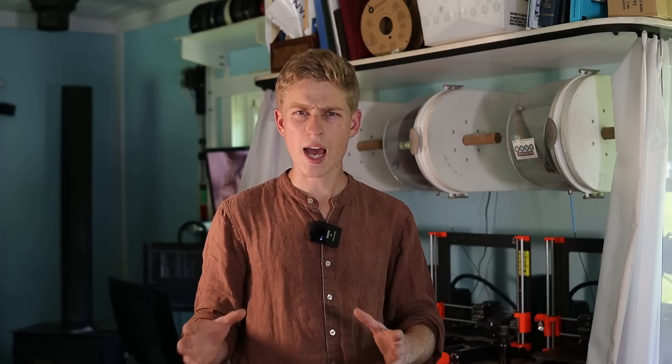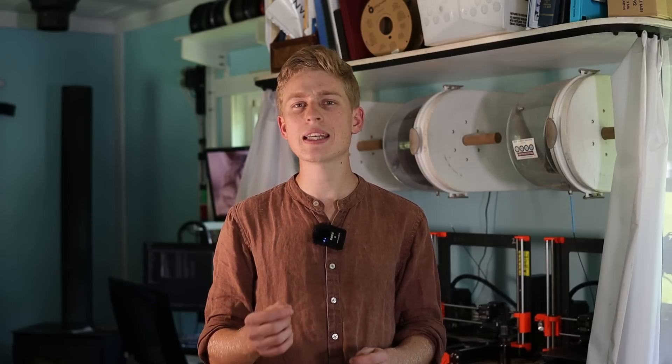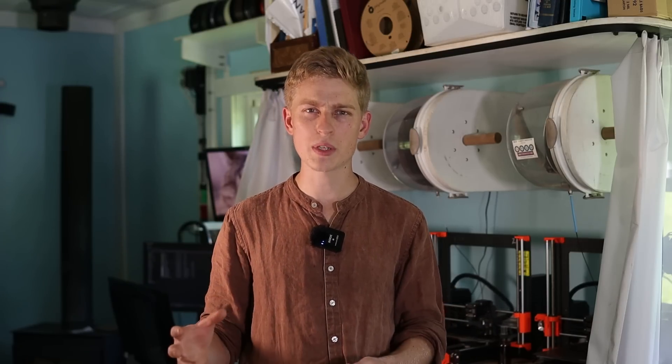More recently a lot of people have been doing content on keeping your filaments dry and why it's so important. I've left some links down below to the 3D Print General who did a great video on it more recently as well. I think it's really good that people are talking about it because it is a super important subject — wet filament is probably the number one culprit of bad 3D prints. A lot of the 3D prints I see that have bad stringing, little pockets, bad surface finish — it's actually due to moisture in the filament. It's a huge culprit and something you should definitely be thinking about, even if you're printing with PLA Plus. It's not as big of an issue as with more technical materials, but it can still be a problem if you live in a humid area.